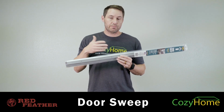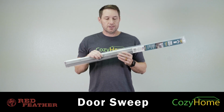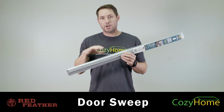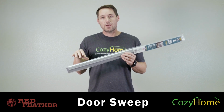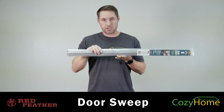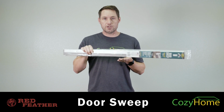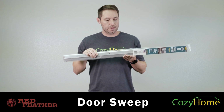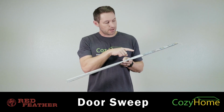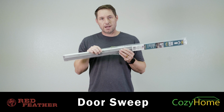It could also potentially scratch your floor if sand or dirt gets underneath it. So ideally you have a threshold under there. You can also buy thresholds to put underneath your door as well, that you can get at any hardware store. But you want this to be barely touching that threshold and making a tight seal when the door is closed, and then hopefully not dragging on the floor as the door opens. This is put on with just screws, so the kit comes with screws, and you just screw it right to your door, and then, like I said, you can move it up and down if you need to.